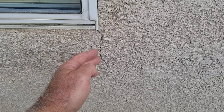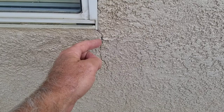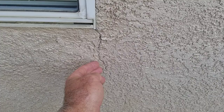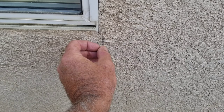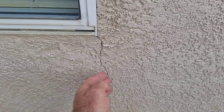You've got to think about why this crack happened in the beginning. This wall expands and contracts, and this is the weakest point — that's what creates the crack. If you fill it with stucco, stucco is rigid and it will eventually do the same thing, usually looking a whole lot worse. Caulking has a little bit of ability to expand and contract, so it's probably the best way in my opinion to fill it.